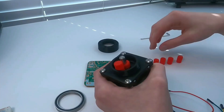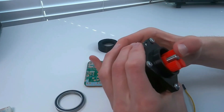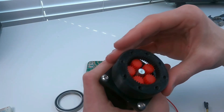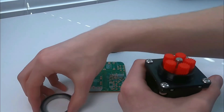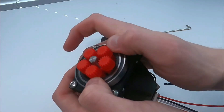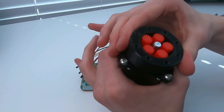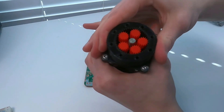I'll stick the first gear in and then go down the line trying to space them about evenly. Then the top ring gear should fit over really easily — and it does. I need to press on the bearing first though. That is a really nice fit. That's the mechanism. There is a little bit of backlash but it's not much at all and I think I could reduce it. Definitely not back-drivable, which is unsurprising.